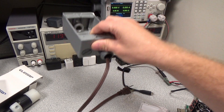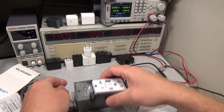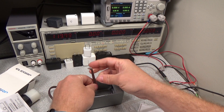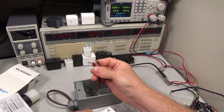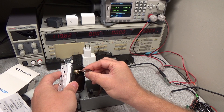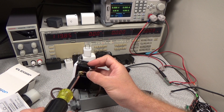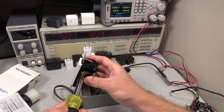Let's get this thing installed into an electrical box and power it up. Here you can see my test box with a cut-up cord and a few ferrules on the end of the wires to make connections easier. All of these USB wall outlets are quite large and don't have a lot of room in the electrical box for anything except incoming wires. These aren't great for outlet boxes that have any extra cabling in them. These will also produce some heat, so ventilation needs to be considered as well. So one wire in the electrical box where these get installed, or an extra large box.